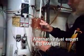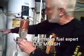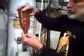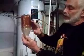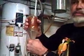This is the ester fuel, the same as what will be in my processor — a sample of what is in my wash tank. The water is used to cleanse it. I put it in this bottle just to give an example of how it separates from the esters. The reason why you put it in water is to clean the oil. If this oil was not good through this process, then this water would congeal with it and you'd have a mess. Care has to be taken to make sure you have a good process here.